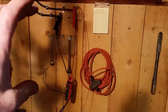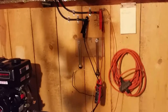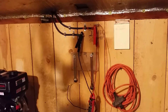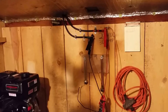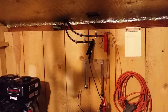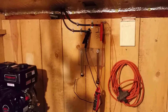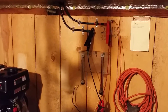I've got a box that goes on the wall up here. It's got a digital data logger with a shunt that records amps in, amps out, volts high, volts low, and more. That'll help everything out and I'll make it fail-safe. I'll put a voltage disconnect relay in it so if I'm not here and I've manually raised the absorb voltage and forget about it, it'll get to maybe 30.5 volts, open circuit, and kill the coil on the engine and we're done.